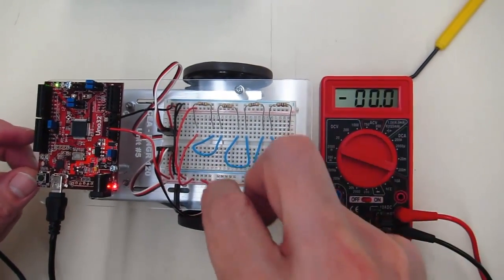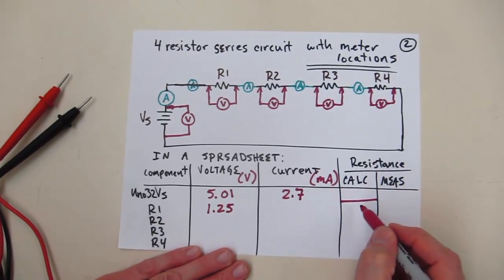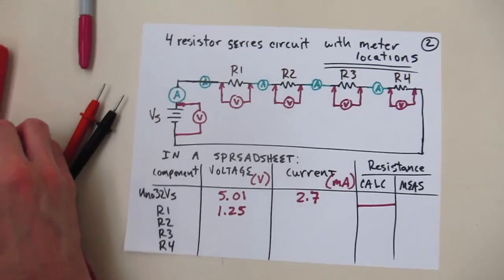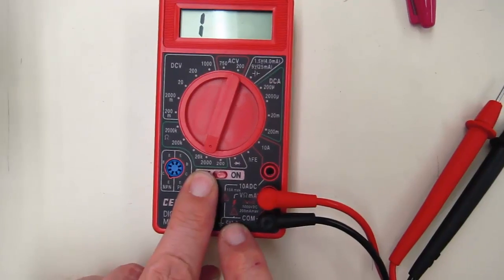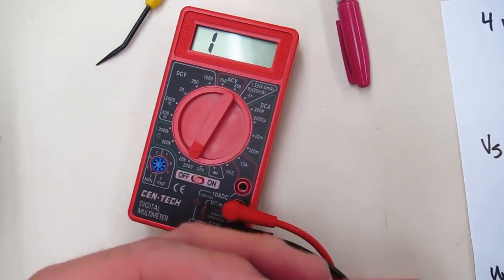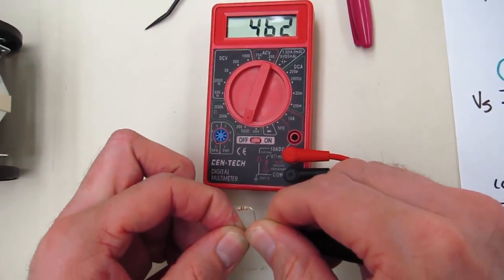Let's put that back together. Our circuit's still in place and we've collected the data. Your team's going to finish out filling in this data and create a calculated cell that figures out what the resistance is based on Ohm's law. Let's demonstrate a quick measurement of one of the resistors — we did this on a bulb in an earlier video. Let's switch it to measure ohms. Since we said they're about 500, I put them on a 2000 scale. Let's pull out one of those resistors and touch the probes to each side of it. We said about 500, and in fact they're 462. You should check them all to see how much variation there is.